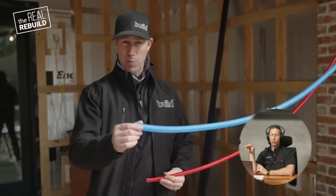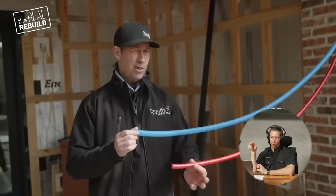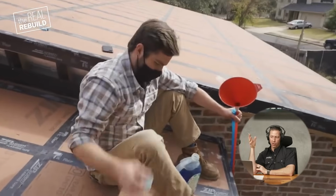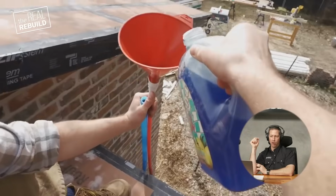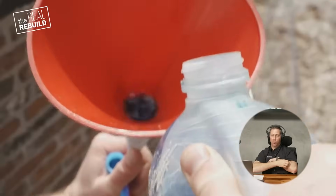I did a little demonstration in this video, and I'm actually going to voice over it. I took 2 10-foot sections of pipe, a 10-foot long piece of 3/4 PEX and a 10-foot long 1/2-inch PEX, and we filled it up. Andrew, who used to work for me, is up on the roof there, filling it up with just some dark colored water so we could see how much water is actually in a 10-foot section of pipe.